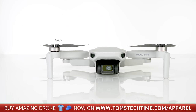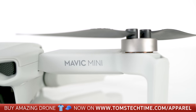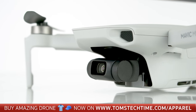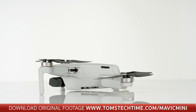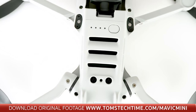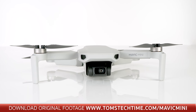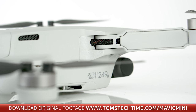Fully extended, it measures 24.5 by 29 by 5.5 centimeters. The drone is made out of standard plastic. It is by far not as durable as the other Mavic models, because DJI had to pick light materials to avoid reaching the 250 gram weight limit. You will find plenty of openings in the shell that not only cool down the electronics but also reduce the weight. You should keep in mind though that the openings are a considerable downside when flying in rain — I would altogether avoid it. It is nice to see that all visible cables are protected by fabric so they won't get damaged while folding the arms of the drone.